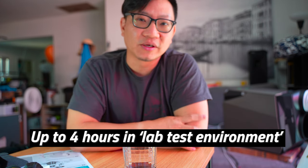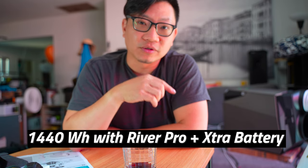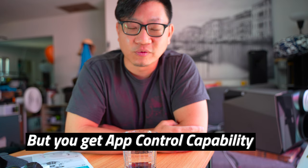What you might find interesting is how other battery packs handle the way the EcoFlow Wave handles jumps in power supply. Also interesting is that when you have the unit plugged in with power, the system internals use about 5 to 10 watts already — just to power the electronic subsystems, including Wi-Fi and Bluetooth. So without even turning it on, just having it plugged in, you're already consuming 5 to 10 watts, depending on the battery pack.